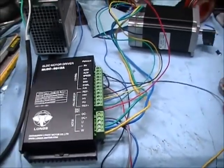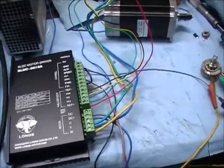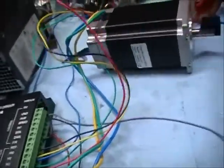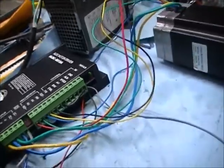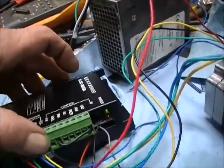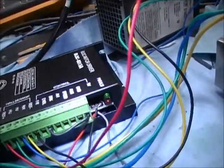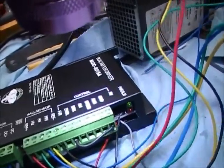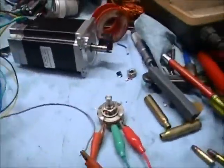The way this thing is going to be designed, I took that potentiometer out — that little bitty piece that was in there. It was working fine, I just want to be able to remote-mount the potentiometer. I soldered three little wires on inside this box right here. At this end there's a red, a black, and a gray wire. You have to be really careful — you can't put too much solder on those things. The black wire hooks on the top right there in the center; the trace on the board goes off to the left. Those three wires then go up here to this potentiometer.